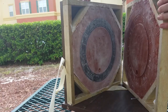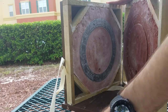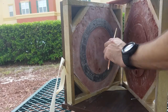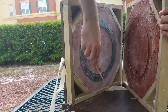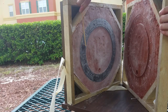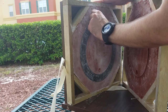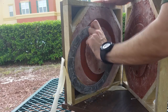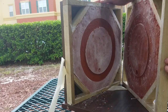Once the green sand is packed, we need to remove the plastic Chakram to form the void that we'll pour the aluminum into. We lost some of the detail here, so we'll need to add it back after we've cast the aluminum Chakram.